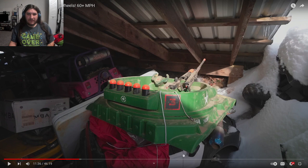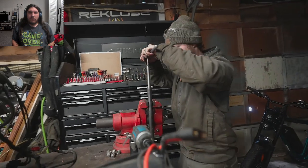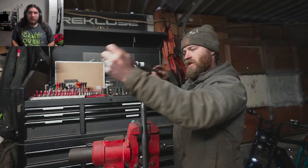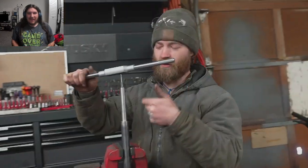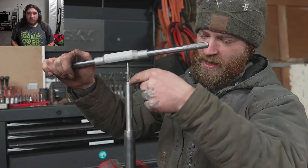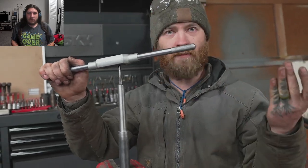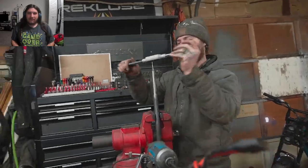There's Cinderella, but this is also part of another build they were doing — they were doing a tank at some point. He's waiting for the power to come back so he can use the mill. He's tapping the ends of the axle because that's how the wheels attach. Once the power comes back he can put it in the mill and cut a keyway, then key everything on there, put bearings on, mount it up, put a chain, and go for a rip.